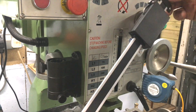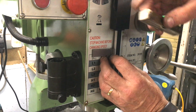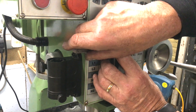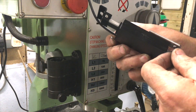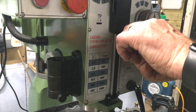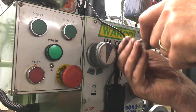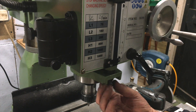Before I could mount this scale I had to grind the top off this awkwardly sited stud. I didn't take it off — I just simply ground it down level with the scale face with a small grinder pad. And to protect the head and the threads behind, I simply packed it with paper. To mark the fixing positions for the slide I used a small engineer's spirit level and a set square. The bracketry was a simple 2mm thick two-hole link that connected the scale body to the stud. The only concern I had was if the top hole penetrated the gearbox, but I was lucky. The old scale readout had a manual adjuster that is now no longer needed, so I locked it off by setting it at the top setting.